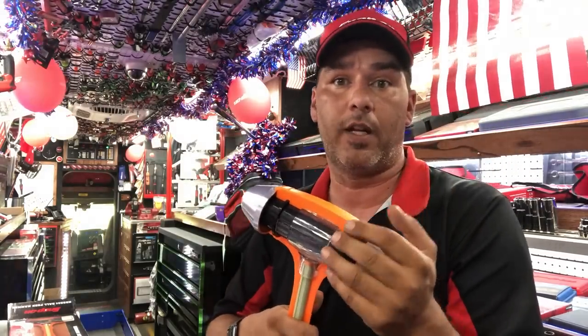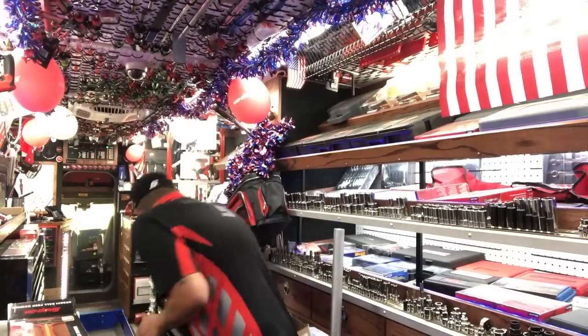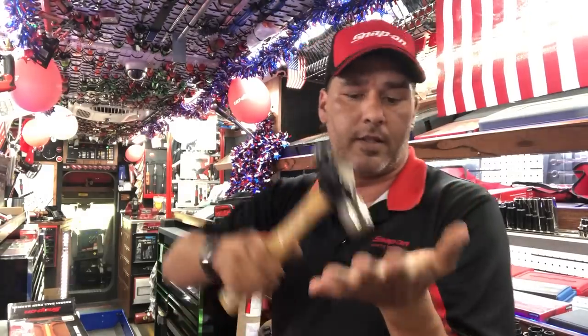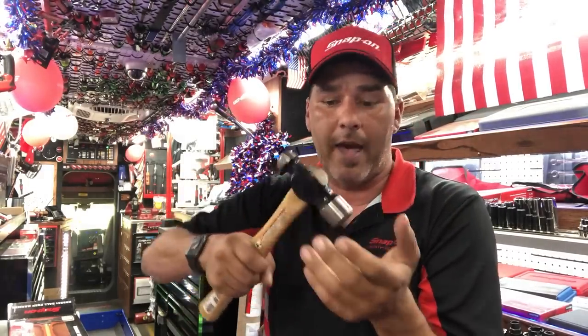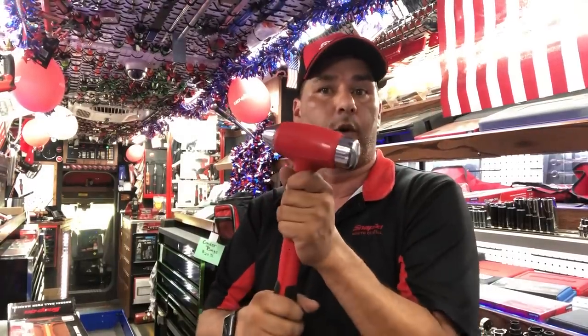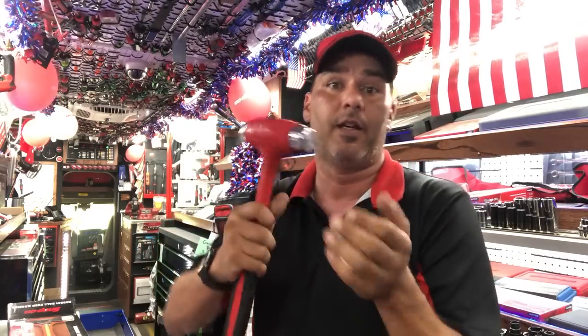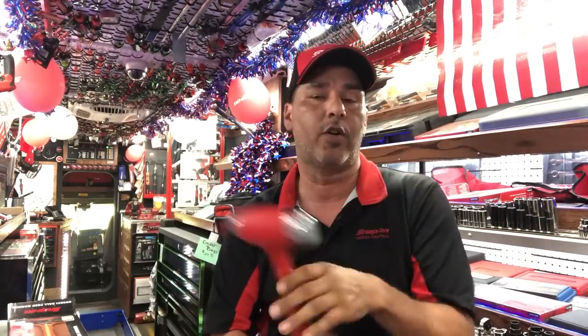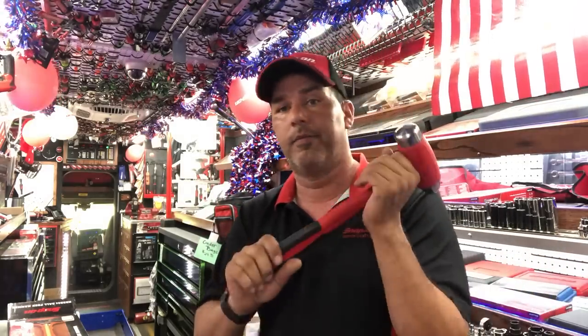It gives you a harder hit when you do hit it, as compared to a standard hammer that's just solid steel through there. If you were to take a 24-ounce regular wooden-handled one — like this Blue Point one or any one you find at a hardware store — and you hit it on the vise and try to stop it from ricocheting back, you can't, because it's tool steel against tool steel with nothing absorbing the impact. As compared to a 24-ounce dead blow: when it hits, it's a solid hit. And with the rubber grip versus the wooden handle, it also saves a bunch of vibration on your hand. So at the end of the day, you're pounding on brake rotors or what have you, you go home and you don't feel as beat up. It's comfort, convenience, get the job done a little quicker because you're hitting harder. Hammers 101.